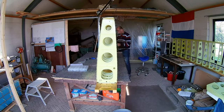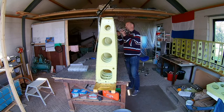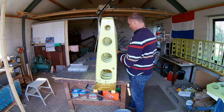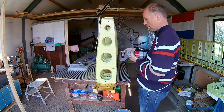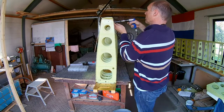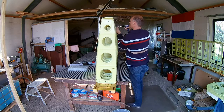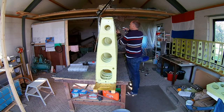As you can see in the right wing I didn't start with the tubing yet. I created the holes so small that the tubing cannot come out, and it's very hard to get in also. Here I'm countersinking the rear spar that I just dimpled — it doesn't do much, it just shaves off a little bit, but it's just enough to get the dimples of the skin in.